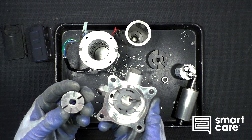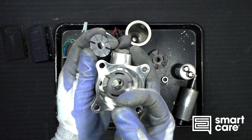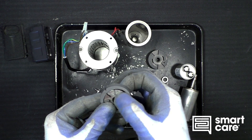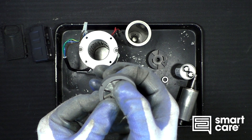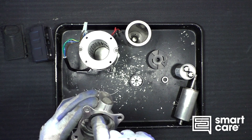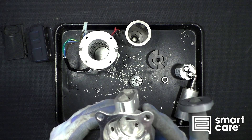And this is probably why they didn't want you to open it up. Each one of these vanes is a precision fit, and the better you maintain that precision, the more efficient the pump operates. As that pump rotates, the vanes create a larger and smaller space. They're constantly sliding in and out. It looks like we'd pick up a little back pressure from some of the slots and the way this housing is engineered. It's a really nicely machined housing — it's like a wax-cast stainless, I think. There's another precision seal on the back.